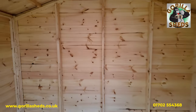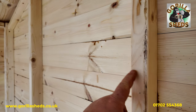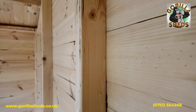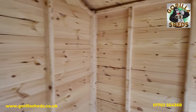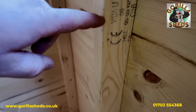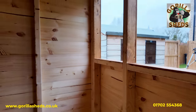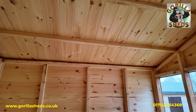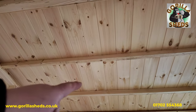Framework on this shed is CLS. So it's 38 millimeters across there, or 1.5 inches. It's 63 millimeters down there, or 2.5 inches if you like it that way around. And somewhere on here we'll find, there it is, there's one under there, a grading stamp. If I tilt up, you'll see it better. That grading stamp will tell you that this is C16 graded framework. So it's the same grade as you'd have on the framework of a house, the internal stud work walls of a house.